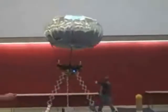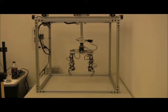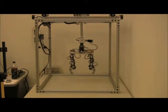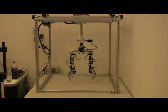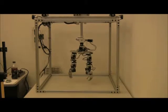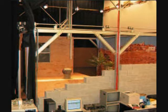From the lessons learned of our prototype vehicle, we have also built a miniature gantry test rig to emulate the UAV and perform mobile manipulation in a controllable and repeatable manner. The mini-gantry provides X, Y, and Z position along with roll, pitch, and yaw orientation control of the aircraft. Based on Drexel's Systems Integrated Sensors Test Rig, or SISTER, the flight emulator uses model reference adaptive control to eliminate error between the gantry state and the flight dynamics model of the aircraft.